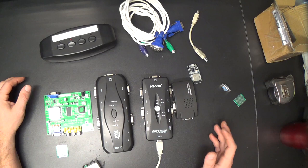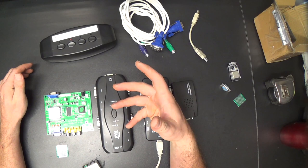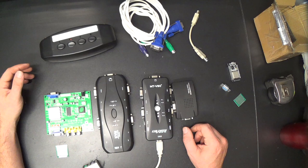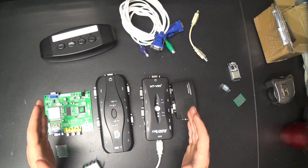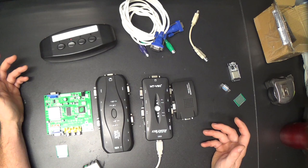As far as input, I think it's Big Mess of Wires makes a contraption that converts from USB or PS2 into ADB and vice versa. And that's actually kind of cool, because I'd like to use an Apple IIgs keyboard as the main keyboard with all of this, because that's my favorite keyboard ever made. They're just excellent. Not the later Mac keyboards that kind of look the same, but the IIgs keyboard, it has Alps key switches, and the layout's good, controls in the right place, and it's so compact. It just fits well on the desk, and it doesn't have a bunch of cruft that you don't need. It doesn't even have any function keys, which could be a problem, but I mean, with USB, you can have more than one keyboard connected.